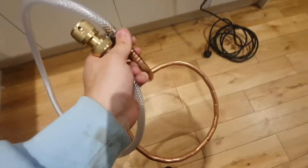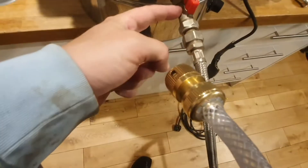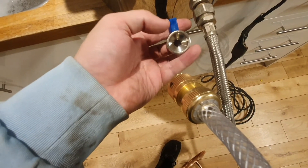All I've got to do now is deal with the outflow of the boiler - the old boiler used to go to a pump. I now want that to go to this hose connection, so I'm going to have to take that valve off and swap it for this valve because it's got the bigger three-quarter inch thread. I'm going to crack on with that.